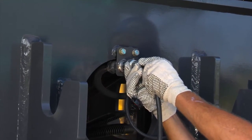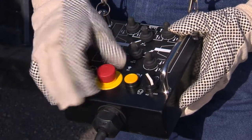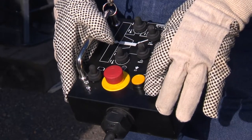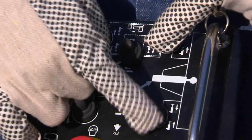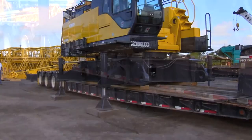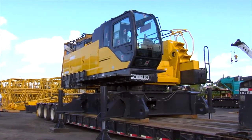The cable to operate the remote box for the translifters will now need to be connected. Start the engine and set the speed to approximately 1000 rpm. The four outside switches on the control box control the four individual translifter jacks. We're now ready to lower the translifter jacks and raise the machine off of the transport truck.